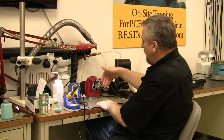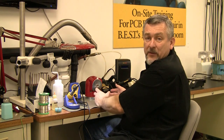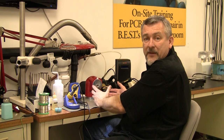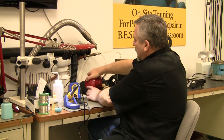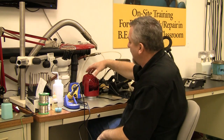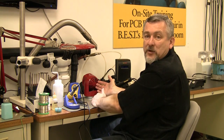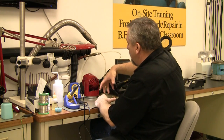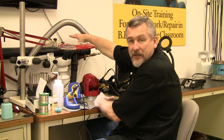If you take this fan and blow it directly toward where you're working to blow fumes away from you, it's also cooling things down at the same time — you don't want that. So you turn it the opposite direction. The fan is going away from you, and guess what? It just became an extraction system. It's pulling the fumes this direction and then away. That's what you want it to do.